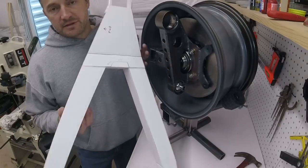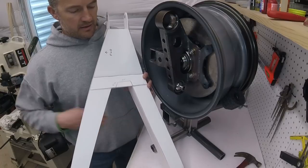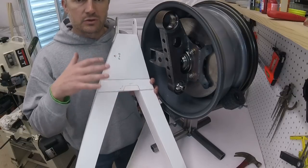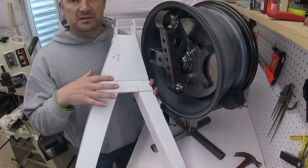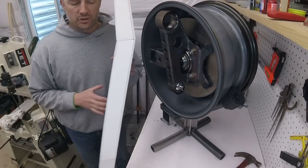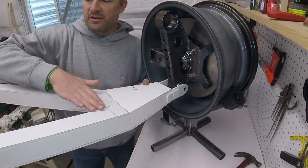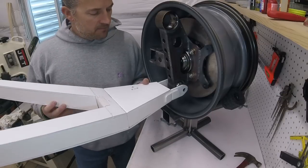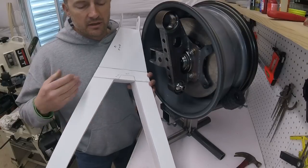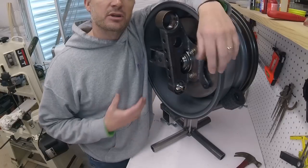So that's when I came up with this prototype. Again, it follows all of the same dimensions. It's got the same offsets, the same lengths. It's essentially the same two control arms that you just saw. The only difference is it's boxed instead of tubular, and it has the same elevation change of 6 inches, just like the one I just showed you. So it goes on here. It seems to satisfy the droop by having this 6-inch kick, and it still has good range of motion. So at that point, I decided the next step was to actually cut one out, tack it together, and see how it looks. And essentially that brings us to where we are.